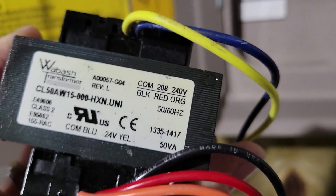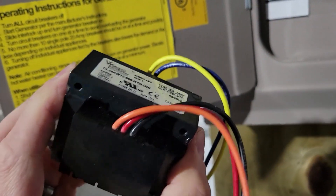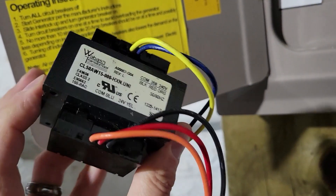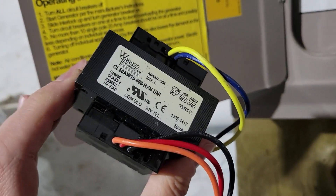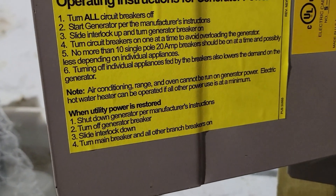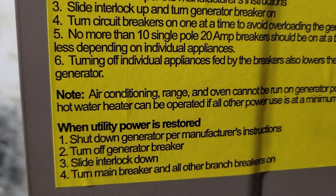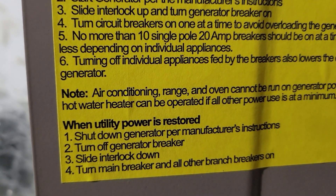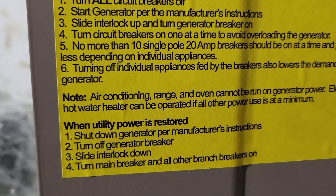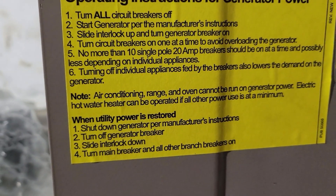The reason is this device here — a 240-volt transformer. It runs off 240 volts and a small portable generator is not enough to energize it. That means it can't generate enough electricity to operate your stove or your main HVAC. If you have air conditioning like our Unico system, it will not operate. The range or oven at 220 volts won't work either. A dryer will work because it doesn't have the transformer on it.